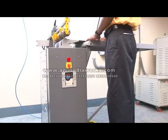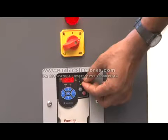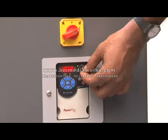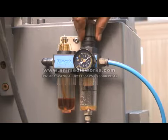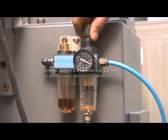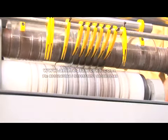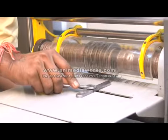Operating the machine. Working position: stand upright in front of the machine. Put on the machine. Use the speed regulator to adjust the rotation speed — this will vary according to the material and its thickness. Thicker the material, lower the speed. Switch on the pneumatic supply line and check air pressure.